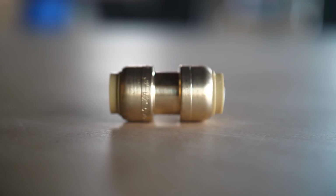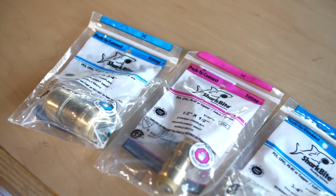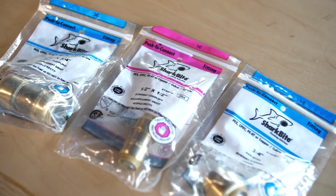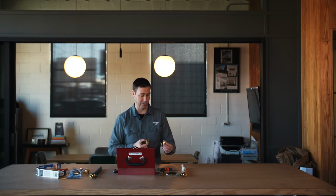Now, if you're a builder or a remodeler, these come in really handy, especially during the demo or the remodel phase. Let's say you're taking out a wall in a house, and you didn't realize that your Sawzall blade hit a plumbing pipe, you just nicked it. You can actually cut that pipe, put a coupling in there and fix that until you get the plumber there the next day or the next week to fix it for good.